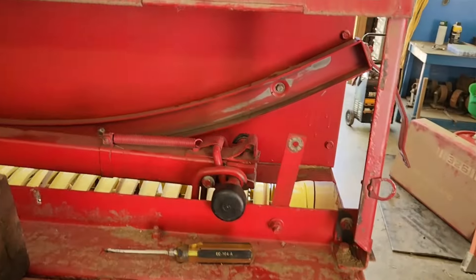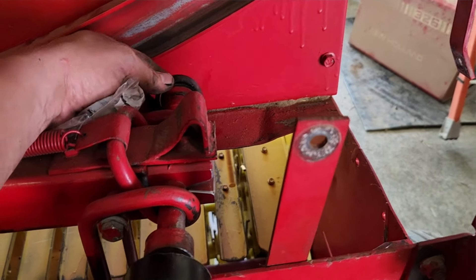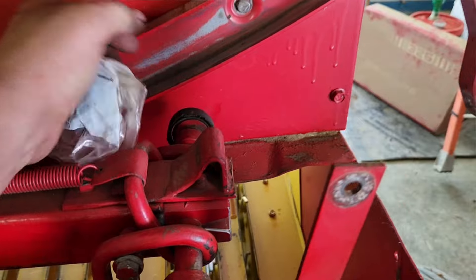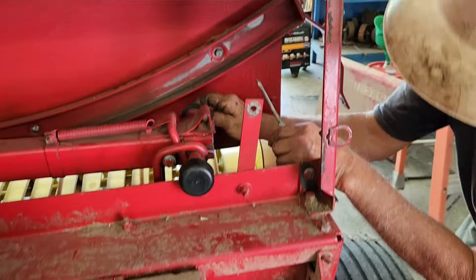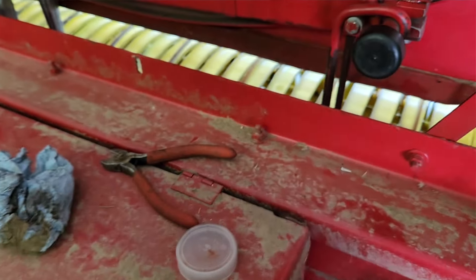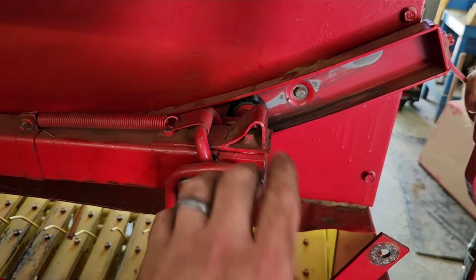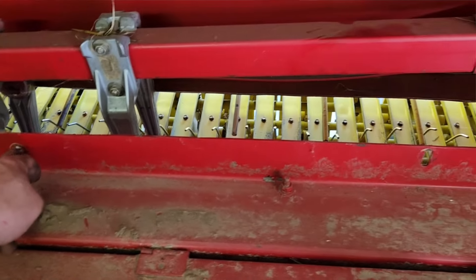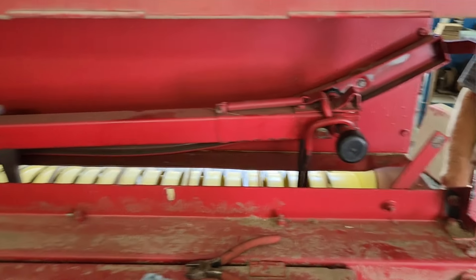Alright guys, we've got the 320 backed in here and just servicing it. Got everything greased. I noticed I had a cap missing, so we put one new cap on. This one's got a decent amount of wear so we're going to see if we can get it off and put a new one on it. The cap number is 624-955. We've got that one replaced — I took the side snips and cut one side to get the old one off, it was being cantankerous. Put just a little dab of grease on to make them slide on better since they're pretty tight. The easiest way to get to those was we took the rail off — it's just three bolts, four technically, and then one on the end. Now we'll put that back in and we'll be ready to roll.